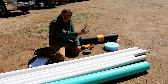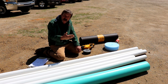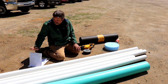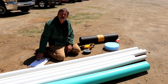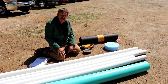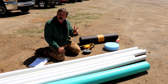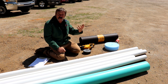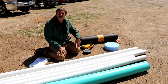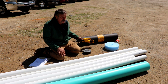The other thing you're gonna want to cut is a 6 inch sleeve when traveling through concrete horizontally. When we exit this house we're gonna have to sleeve it because we're gonna go through a footing — there's a footing all the way around it, always is. Pay attention on your plans; you might be going through a footing somewhere in the middle of the house as well. If you do have to go through the footing you have to sleeve it with a piece of pipe that is 2 pipe sizes bigger. So you have a 3 inch pipe, a 4 inch pipe, then a 6 inch — we sleeve it with the 6 inch.